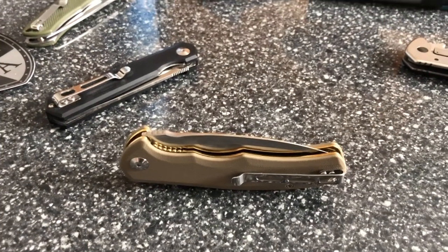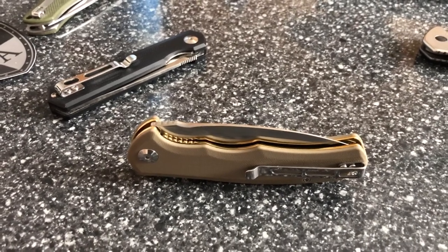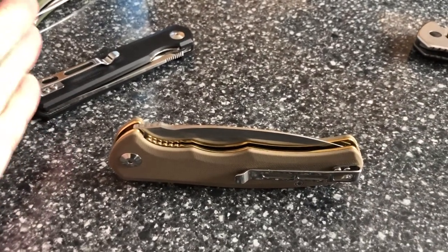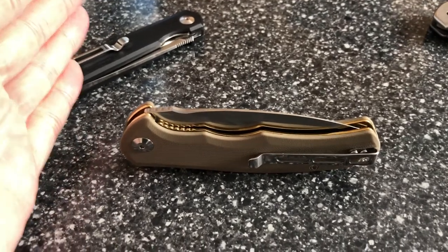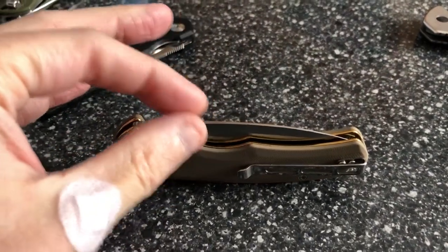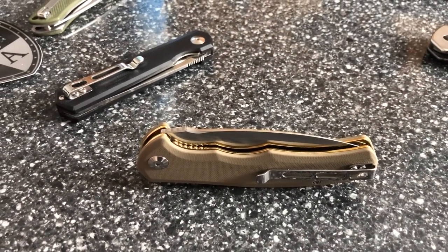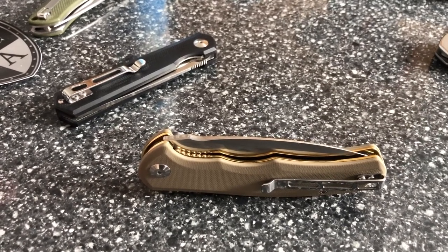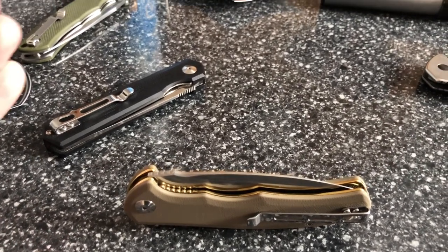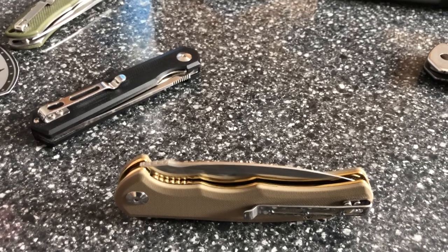Hey guys, quick note. I ended up cutting the part of the video where I did the pink and the green. Simply because after doing pink and green, and after playing with 600 with the ceramic, I decided to just go back to 320 and scrap my mirror edge and get rid of that little gray line on the apex. So I just went back there and redid it all, from start to finish. It was starting to get a long video, guys, so I decided half an hour would be enough. So I decided to cut those last parts and just show you guys the final product with the white 0.3 micron, at the end.